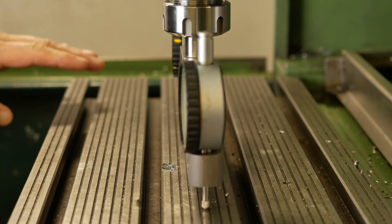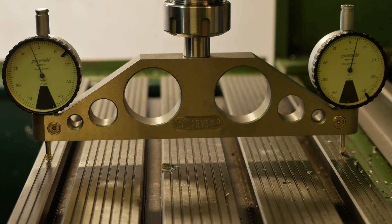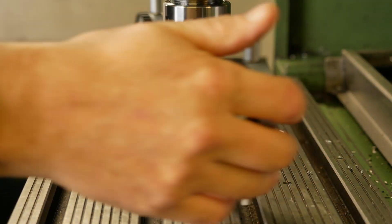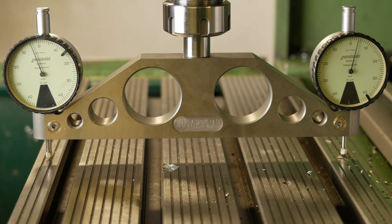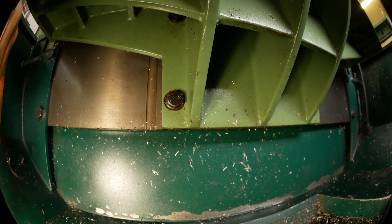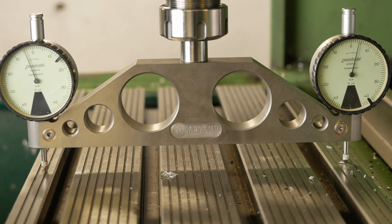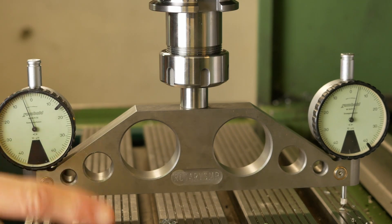Back to the X-axis — since both of those clocks have already been zeroed out onto a level plane, I should be able to just turn them and read off the error. That means the table is tilting forward. I'll rotate that round to the other side and cross-check that reading — same reading. So four plus four, we've got about an eight one-hundredths tilt forward. Now there's no real adjustment for that; the table is just bolted on with four bolts. I could take the table off and clean the surface, or the other option is to shim. The correct way is to pull the table and scrape it to bring the mounting surface back perpendicular to the table. Do any of you have a good recommendation for tramming out a saggy table on a console-style milling machine where this is all just fixed and bolted? If you do, please let me know in the comments section.